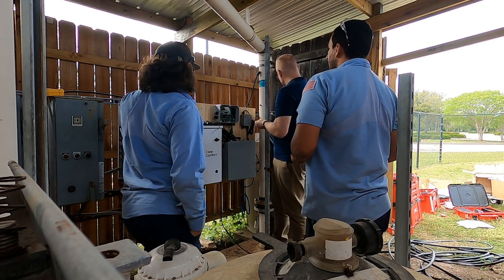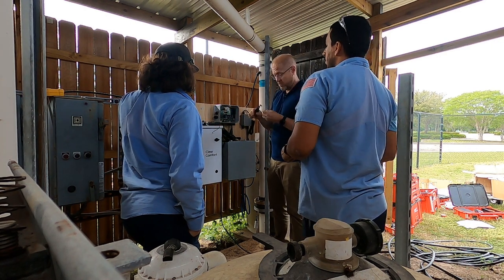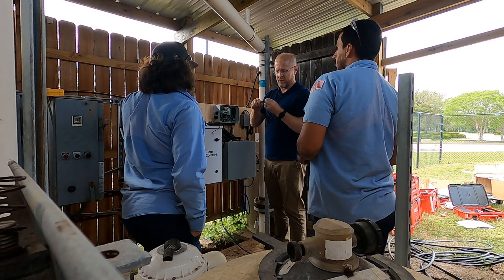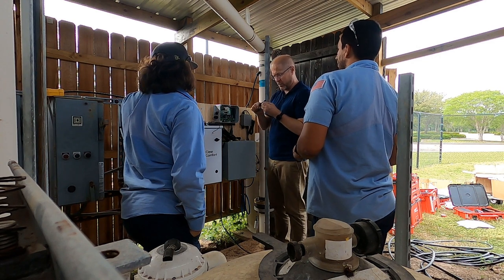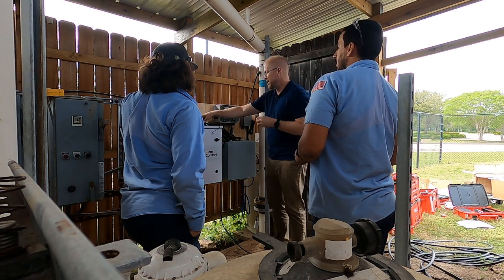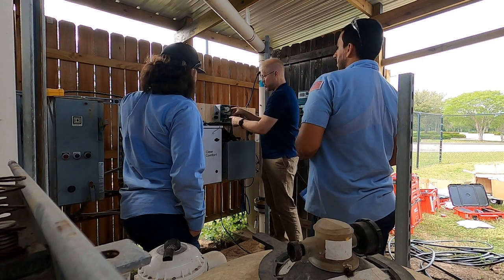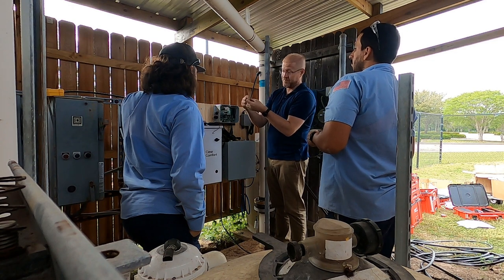Yeah. So we've got a flow switch hooked up, and we're going to hook up this current switch, but number 3 is going to be empty, right? And so what the dip switch does is it turns off the light for it, so that it doesn't illuminate. Because the firmware programming for it, you can't disable any of these. So one is going to be our flow switch, 2 is going to be our current switch for the pump, 3 I'm jumpering. What can it be for?